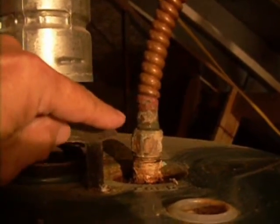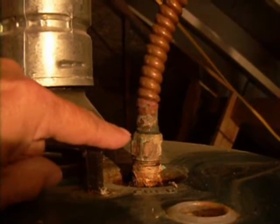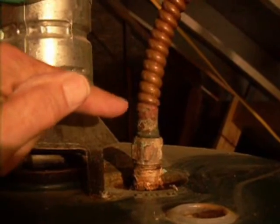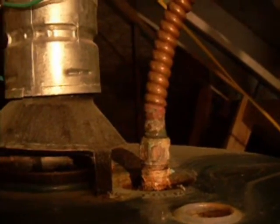There's a little bit of water coming out. Left unattended, that's going to leak a great deal. Also, because of that leak, it indicates there's probably — though not guaranteed — rusting internal to the water heater, and it may not last many more years.